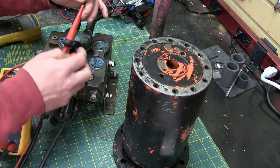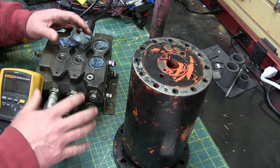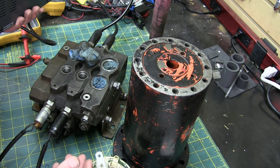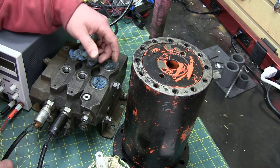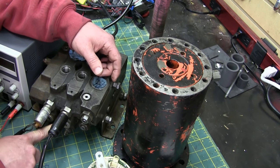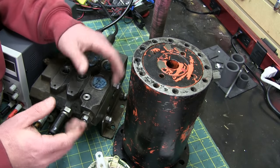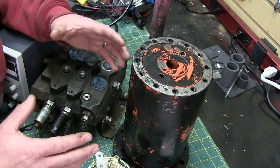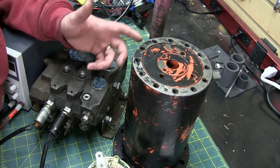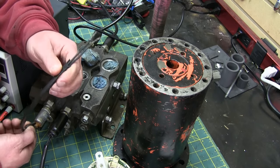All reading 28 ohms — good news, they all have the same resistance. Now I do not know the operating voltage this is designed to run at; best guess would be 24 volts. But we're very much in luck because we have a manual override on these valves. So we can manually override it, see the distance it travels, and then give it voltage until we travel that same distance — that'll tell us exactly what the operating voltage is. We have these little pigtails, though this one's chowdered right to hell, so we won't use that until we fix it.